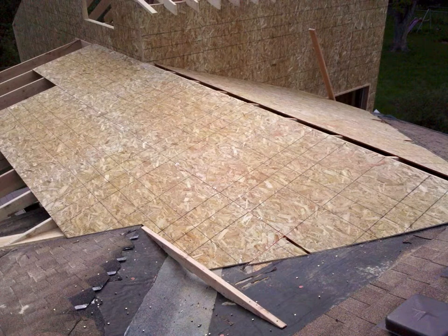Consider what's done with porch roof additions to protect the home during construction. The shingles are analogous to the cladding, and they must be removed for the structural connection of the roof over the other roof. But the underlayment can be left there for protection. When the shingles are installed later, the underlayment can be properly installed into the new valley. And this is the same way that the water resistive barrier over a deck can be later terminated when the flashing is installed.